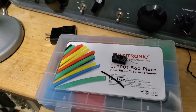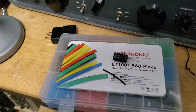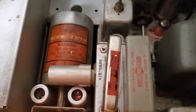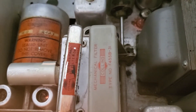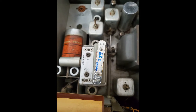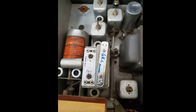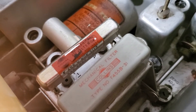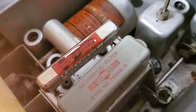To secure it, I put some hot wax on it, and that kind of helped keep it stable. Let's look inside — there's the new filter. Totally different than the original 75A3. This might be an R390 filter. Here it is without the filter, and here it is with the filter next to it. You can see it has some leads in there with the heat shrink, and it works.